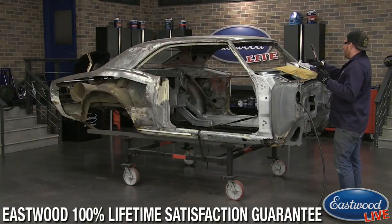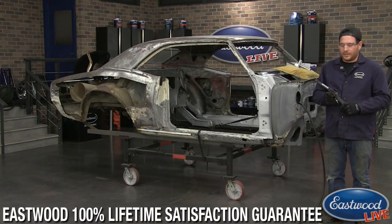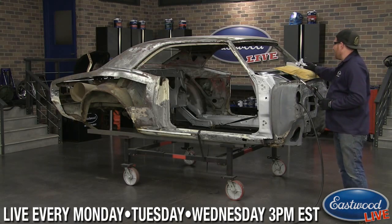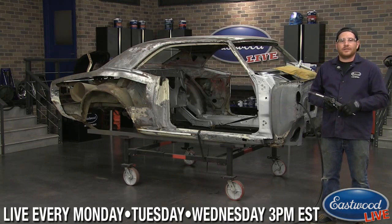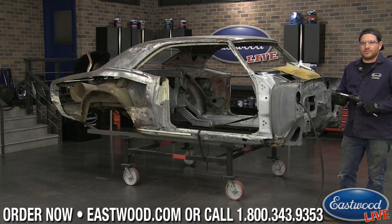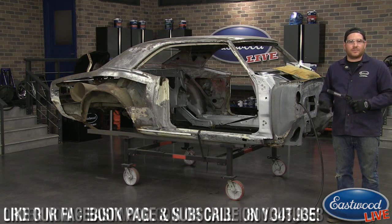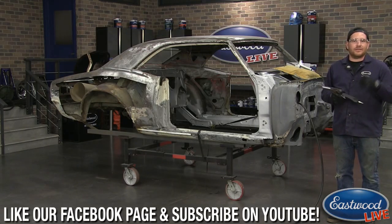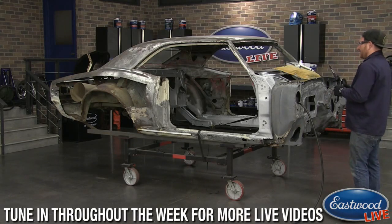Now, again, we do offer a couple different belts for these. For the larger 1/2-inch belts, you can get 40 grit, 80 grit, and 120. On the smaller Mini belt with the 13-inch belts and the 3/8 width, you can get 80 and 120 on those. But that pretty much covers small jobs like this. It's also good for working up in wheel wells and things like that if you need to remove undercoating or get at spot welds in a repair area. You can get up in there with this, and again, you're not damaging the metal all around it with a grinder. So that's why these are really key.